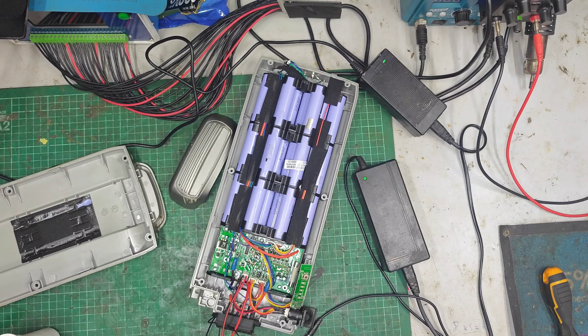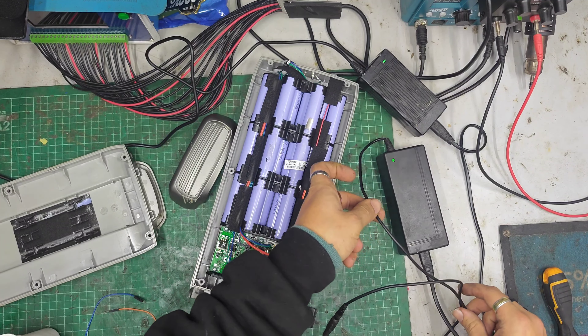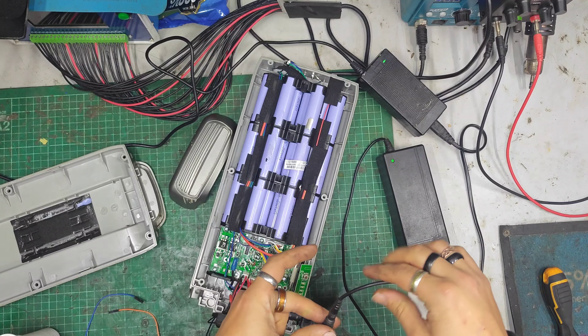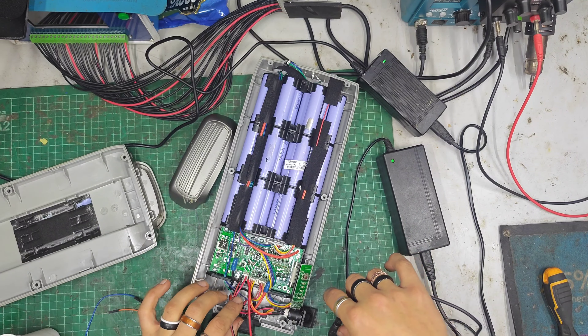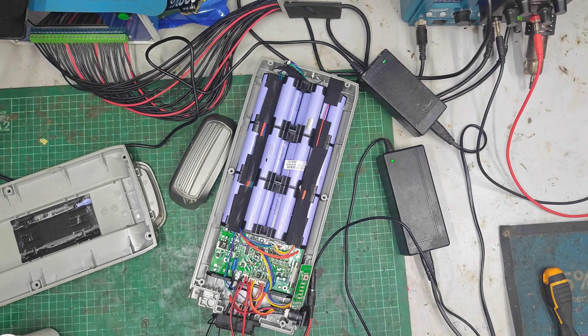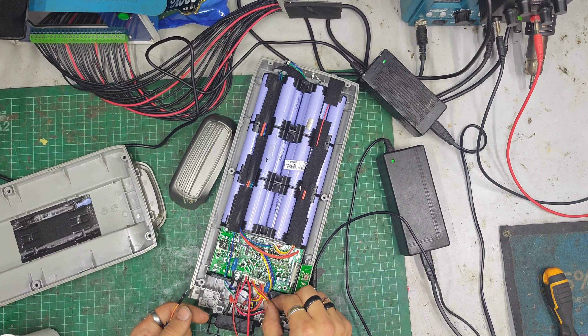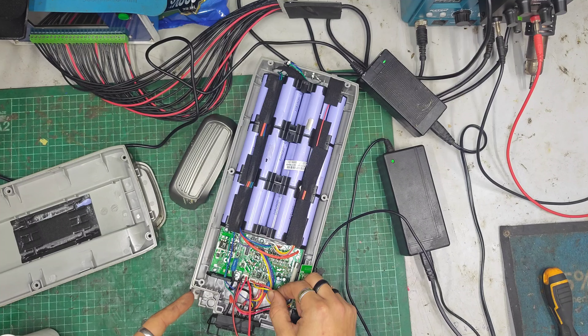The only way I've found to make it charge is if you get your charger — I've hooked it up to an adapter here just so I can break it out into positive and negative into the charge port. Now on the board, there are two ports coming off the charge port: the plus and minus, and then there are these three others. On the left we've got the red wire — ID; the orange wire — common; and the third wire, the yellow — temp.